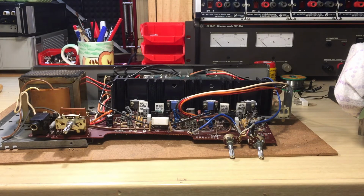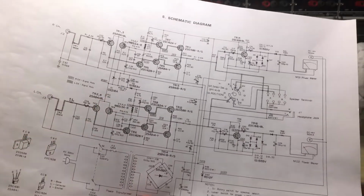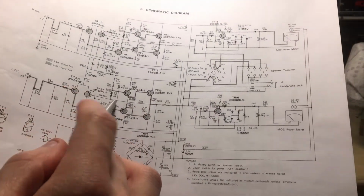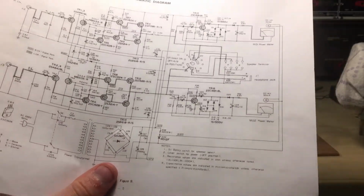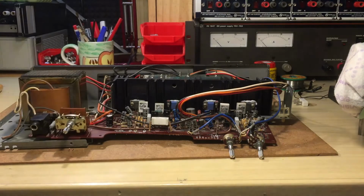So where is the problem? Capacitors, maybe a leaky capacitor, as you have seen. I also replaced the capacitor that was right here. I was suspecting that because it's right across here and it receives a high voltage from here. If this becomes conductive, you will see a high voltage right there. But this is not conductive. It's not leaking too much, at least. Anyways, capacitors are not a problem in this case.